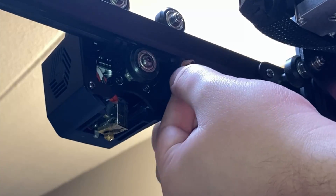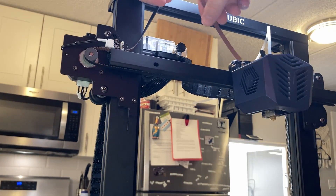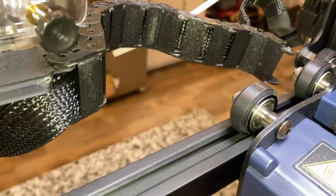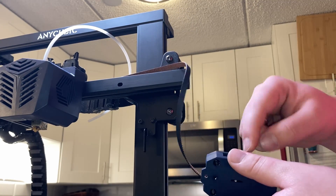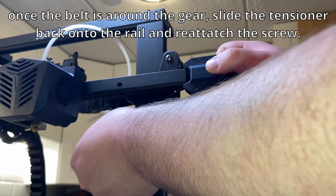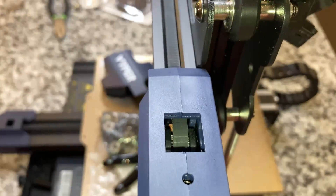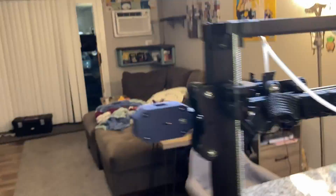Taking my now crimped side of the belt, I fed it back into the slot the old belt was in, and wrapped the belt up and around the X-axis motor gear, then slid it under the wheels of the printy part. Make sure your belt is in the top and bottom groove during all of this. Then I grabbed the tensioner and wrapped the belt around the gear inside. Finally, I wrapped the remaining belt back under to where the crimped side was, slid the belt into the other groove, and slipped the crimp on. Make sure your tensioner is loose and hold the belt tight as you crimp it — once the belt is secured, you can tighten it back up and there won't be much slack.